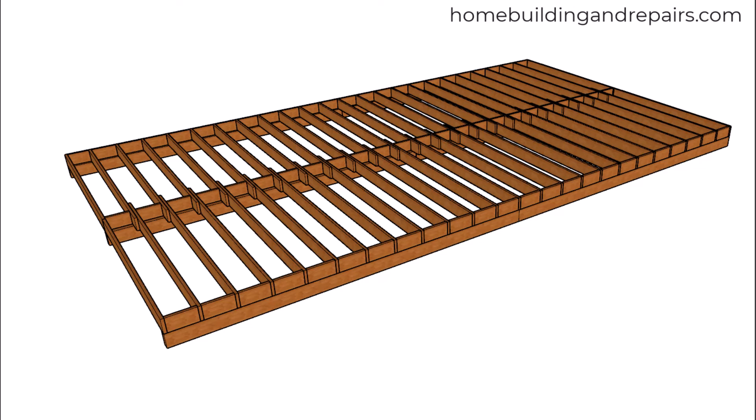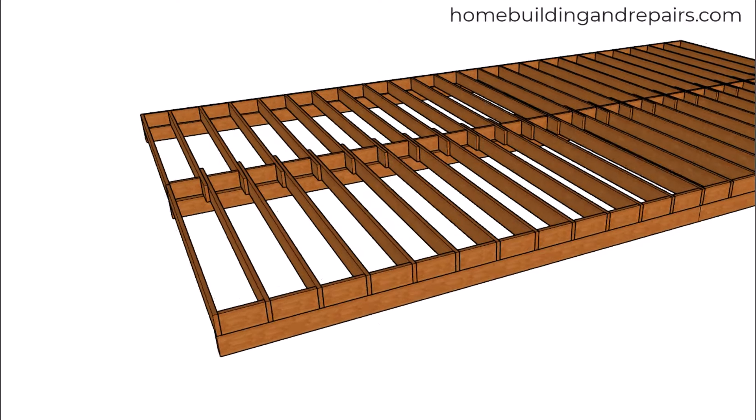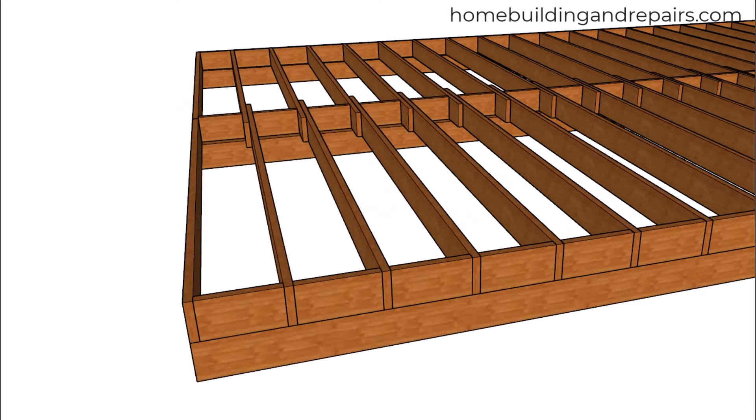In this video I will show you how you can install floor sheathing if the joists aren't lining up because they're lapping over a floor beam, or even in some cases connecting to a floor beam with joist hangers. You can always get rid of the lap by lining the joists up — they can usually break half on a 4x beam where the minimum bearing distance for the joist is going to be an inch and a half.